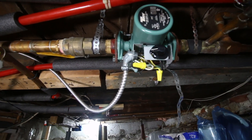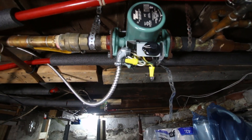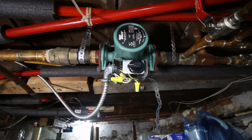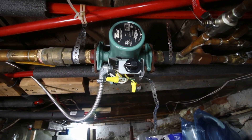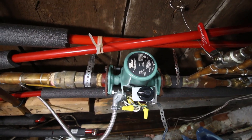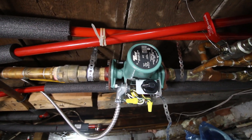The pump is working — I can hear water circulating. That is because there is air in the system now because I had to drain it a little bit. I have automatic bleeders that will bleed that out in about a day. If you don't have automatic bleeders, you have to bleed the system manually. That pretty much shows you how to replace a circulator pump in your hydronic hot water heating system.